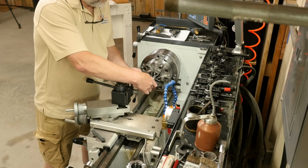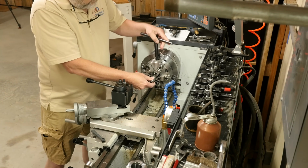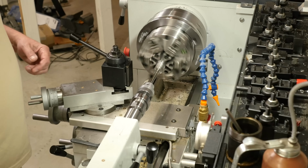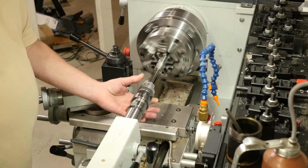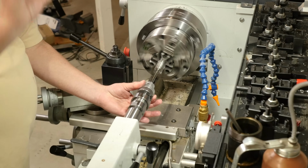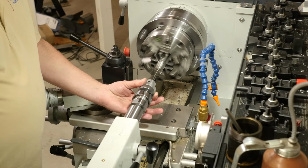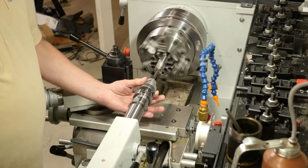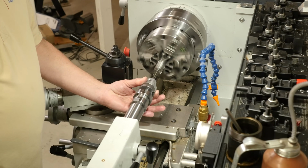Right. So back to the chambering, tell us about the different levels of plunge that you do, cleaning and that kind of thing. So the initial cut, I'm concerned about hitting the rifling with the throat of the reamer. If you were to jam in too quickly, the reamer's going to have to cut the rifling off all in one pass. Very hard on the reamer and not good for your setup because you're putting a lot of stress on everything. So what I like to do is bring the tailstock up close. Because we're using the floating reamer holder, I just steady it so that the tip of the reamer goes into the bore nice and smooth. Yep. Lots of lube, of course.